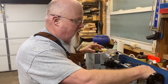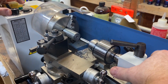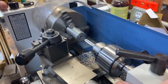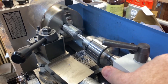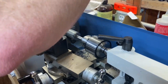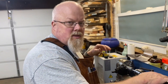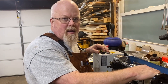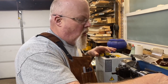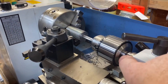Now we're going up to a 5/16ths tap — this is a 5/16ths by 24 tap — and we're going to see how that does. We're going forward at a moderate pace, tail stock loose, slowly pushing this into the workpiece. And it looks like it doesn't have enough power to power tap a 5/16ths bolt — too much resistance, not enough power to pull that into it. But that's nothing to be ashamed of; this is still a very effective lathe. Just a regular standard tap in this situation is not able to work at that size.